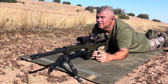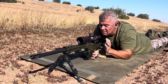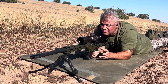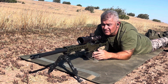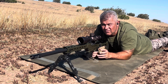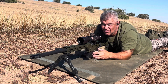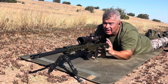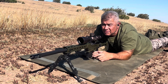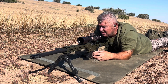I'm here having a little fun with my chassis gun, the Delta 5 Pro. I saw a video where a guy was converting .308 brass to 6.5 Creedmoor. I went through the process and it wasn't very hard to get it done, but I ran into an issue — when I try to put my powder charge, the same one I'm using on the Creedmoor brass, it won't fit. It's got less capacity. I don't know if it's because the shoulder angle on the Creedmoor is a little more steep. So I'm gonna fire-form a couple — once I shoot them through this chamber and see if they're fully stretched out, let's see if the brass can take the same amount of powder.